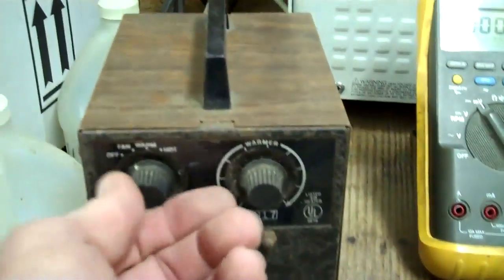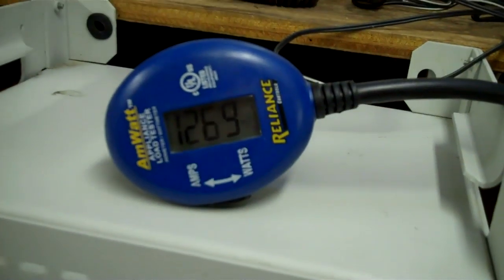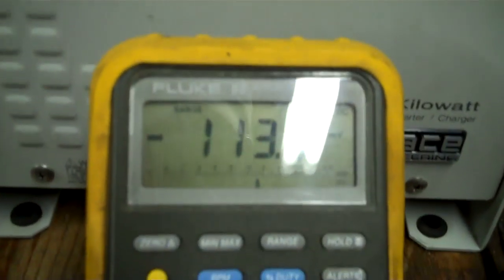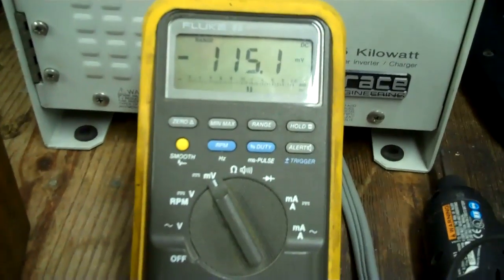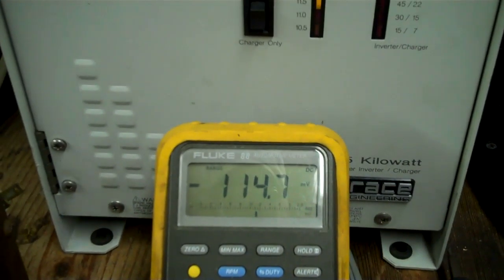We're drawing zero amps and zero watts. Let's abuse this system a little bit and show you some of the misconceptions — we're going to pull 1000 watts AC off of it. You can see we're at 1250 watts. It'll come down as it heats up. Right now off the battery bank we're pulling 112 amps, which is pretty substantial. It's showing it pulling the voltage down to the minimum, and a lot of that's due to the cables being too small on this little mock-up. They're starting to get warm already. Battery cables are a big deal. This also shows that running heat off an inverter is just not really an option unless you've got a huge system.